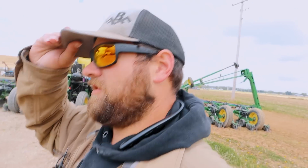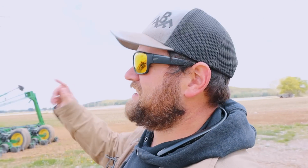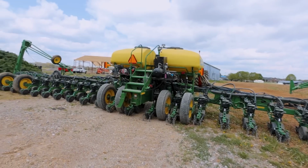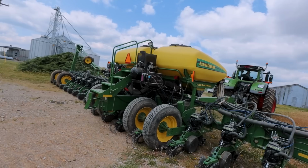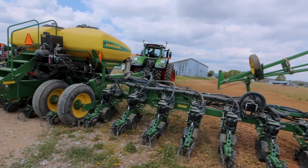We've been running around in circles trying to figure out why our compressor wouldn't turn on after that. We forgot that it is tied into the lift hydraulic circuit, so we bumped the planter down on accident. It kicked on. So yeah, these first days hooking up and trying to get ready for planting is a lot of us trying to relearn how to use a piece of equipment that we used for months last year. But we haven't used it since probably end of May, so it takes us a little while to get the hang of it again. We're getting it.